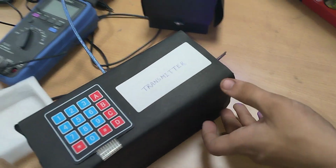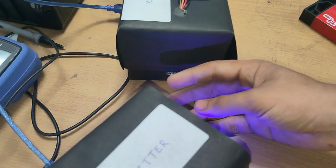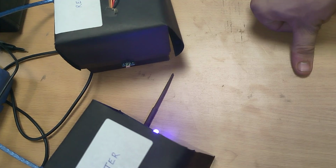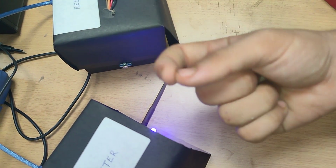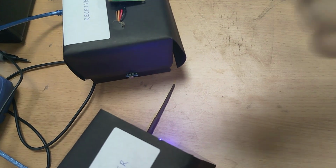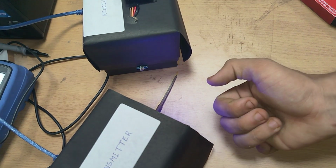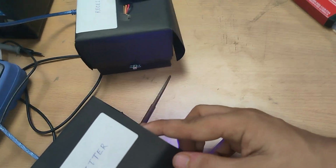What happens then is that it connects to the LDR sensor. As the light goes into the LDR sensor, the LDR sensor changes its resistance, based on which it gives the input in a range of values. As this is the case, we can take a particular value and see if the input, because of the light, is above this set value, and we will call this value the threshold value. The threshold value is a point where before this it is 0, after this it is 1. This is how it sees how the zeros and ones are working.